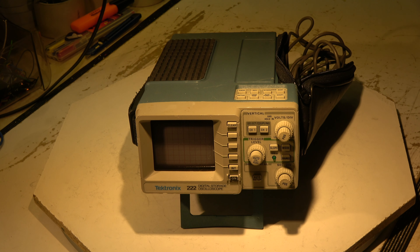The seller said it's not working. I will see how it behaves, what the scope says, what the battery says, and we will look for the faults. I have connected 15 volt DC to the back side here with the intensity at highest. But when I switch it on, nothing happens — only a short beep. No current flowing. So the scope is absolutely dead, as promised by the supplier.